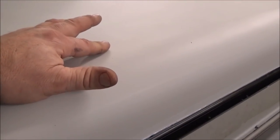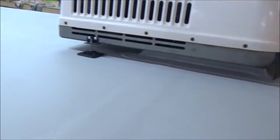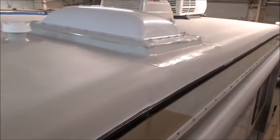This metal shoulder that goes across — we put one right on the top here. When this metal shoulder gets put on there there are some staples in there, and I don't want one of those to breach and come through the main roof. So it's basically a protective strip, but those strips are actually glued down as well — that'll help keep everything in place. And we are done. Go to our website rvroofinstall.com — you can see a lot of videos.